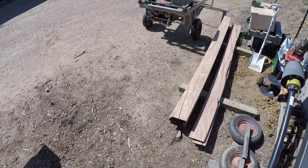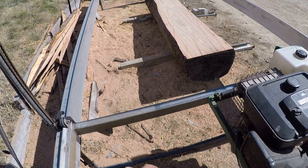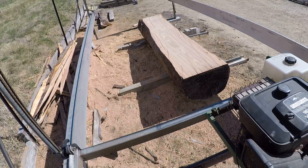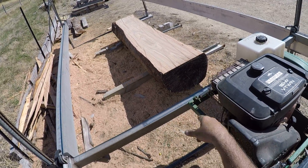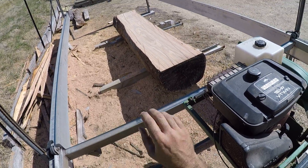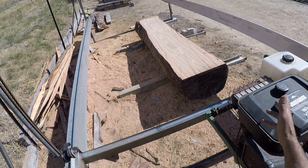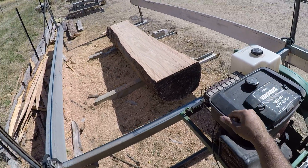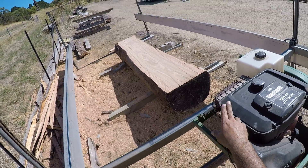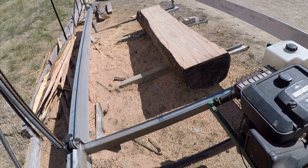You can see I've taken some planks off already off this log and I've hit a spot where it looks really nice — good enough for a slab. So I'm doing some back-sawing, sawing the back of the grain. I find that once you take the top off the log with the dimension cutter, you can make the decision whether to keep cutting with the dimension cutter or get some slabs. This is usually the best spot — you're going to get the best quality slabs out of the back-saw section.